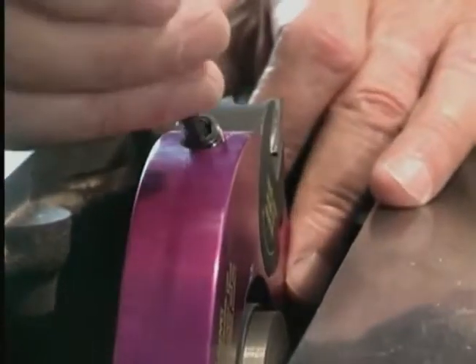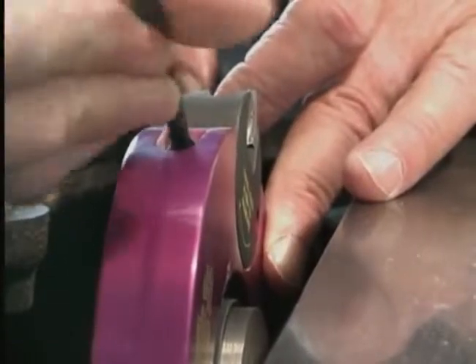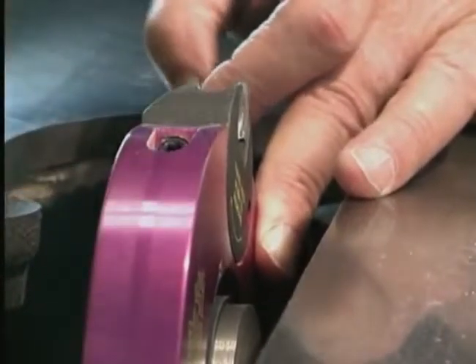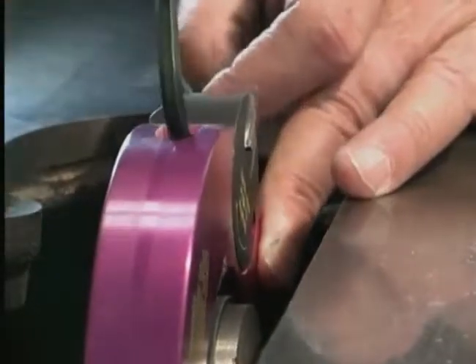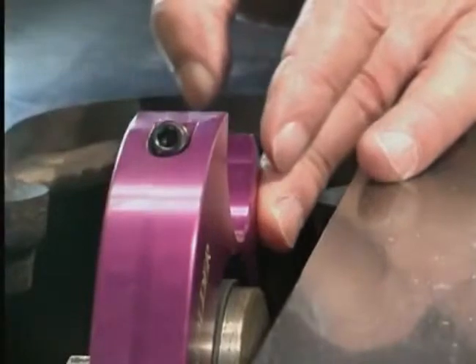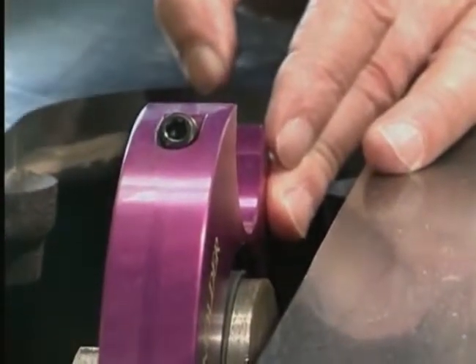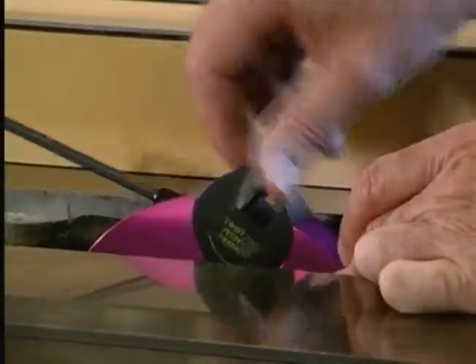The cavity has been machined below the center of the circle and the plug is virtually impossible to be detached. Repeat the process for the remaining cavity or cavities if you're using the four-wing head. The allen head set screw is both a locking mechanism for the plug and an index pin to align the plugs in the head.